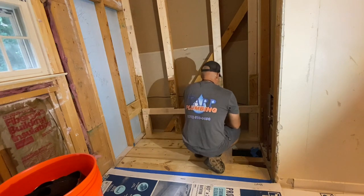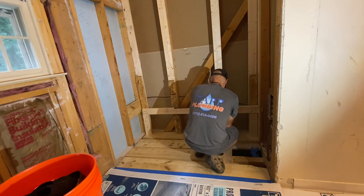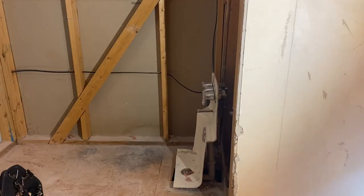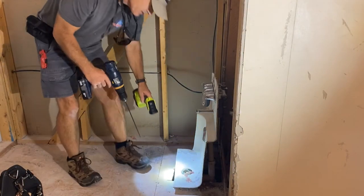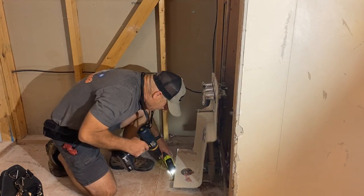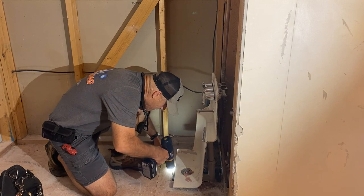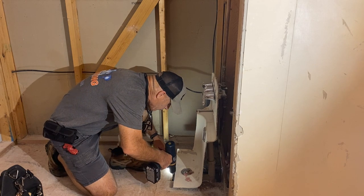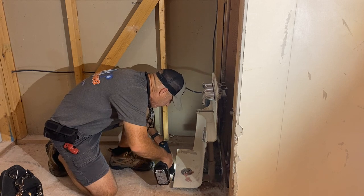For that to happen, we have to have this horizontal board right here dead level and at the perfect elevation. Now we're going to go back to the beginning — what I'm going to do is take that flashlight and look down through the hole to make sure there's no wiring under there and to find out where the water pipe is that serves that valve. Then I'm going to run the drill down through there.